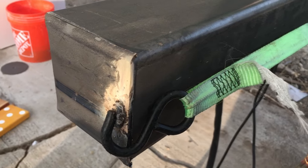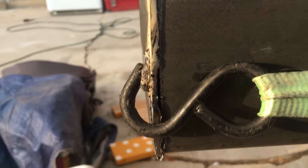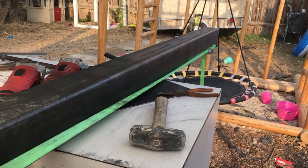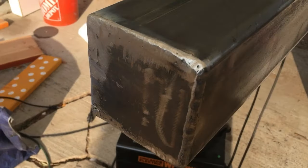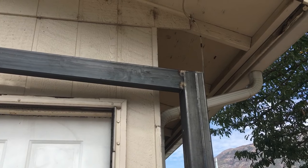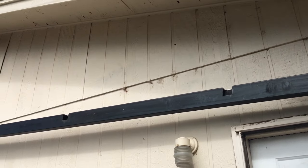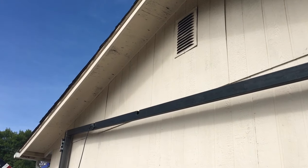I cut and bent over the top — this will be the cap for each one of the vertical supports — and I'm pulling it tight so that I can weld it up. It's not the best job but it'll do after I've ground it out. I've only tacked that side for now, and as you can see I've notched out the sections for the cross beams.